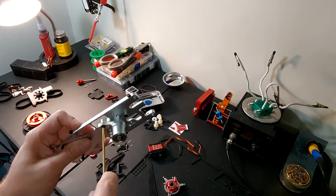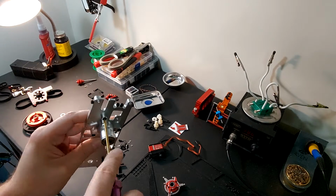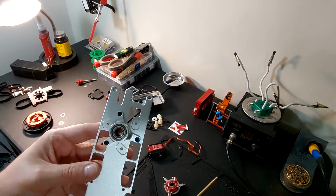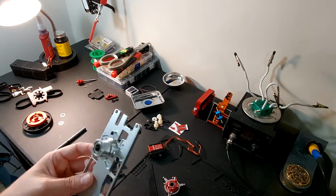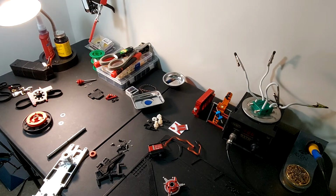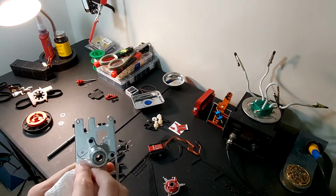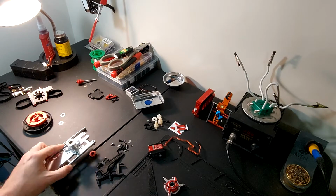Alright, we can go ahead and cinch them down now. You are screwing really hard steel into aluminum. The reason you're using Loctite is so that they stay. Just make a nice firm tighten. You definitely do not have to over crank it. Because I use so much Loctite, a lot of times I'll just do this just to clean up where it was coming over a little bit.